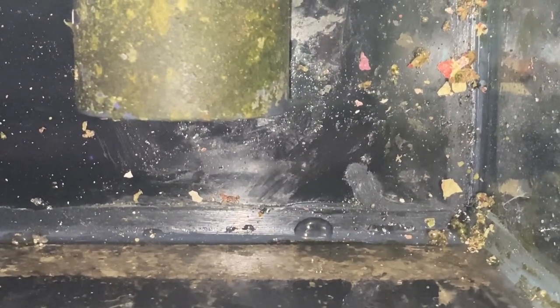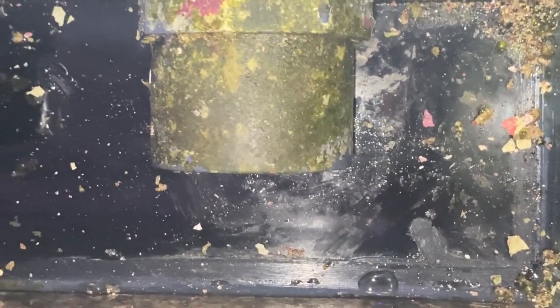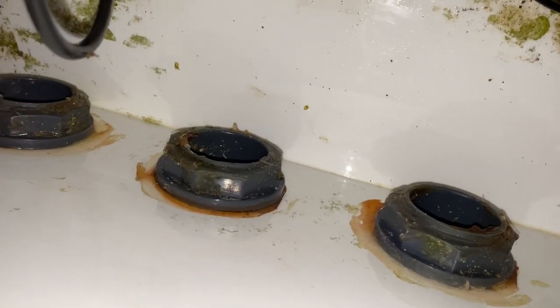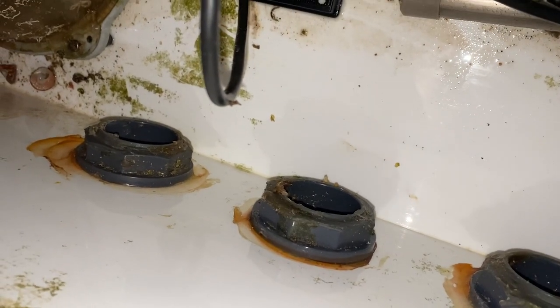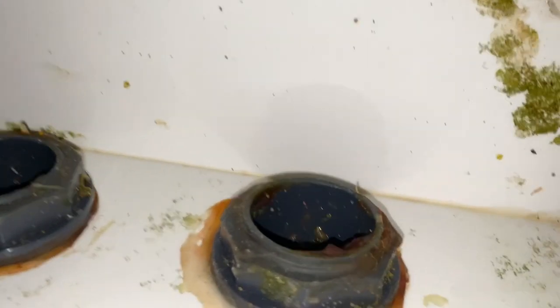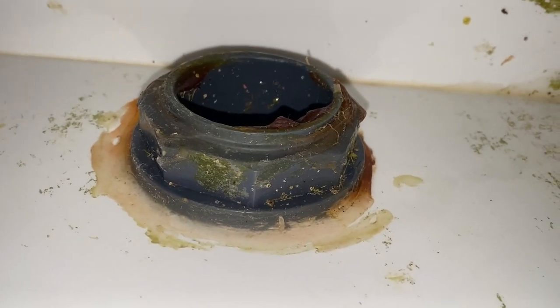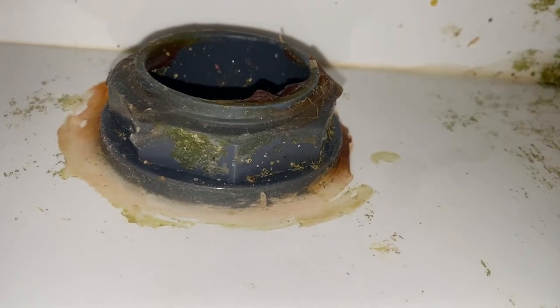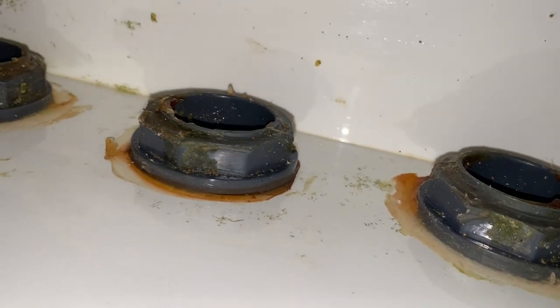We've just discovered a new fun added feature — the weir leaks too. So this compartment I need to get as clean and dry as possible. The water is slowly leaking from the main tank, which I was hoping to have off all night, into this one. It's not perfectly clean but that's probably the best I'm going to get it. Remember, this is only a temporary repair until someone can come and properly fix it. The aim is to cover it in silicone all around where the old silicone is, and hopefully that will do the job.